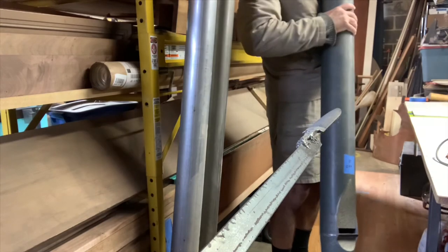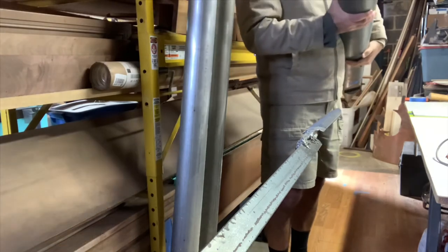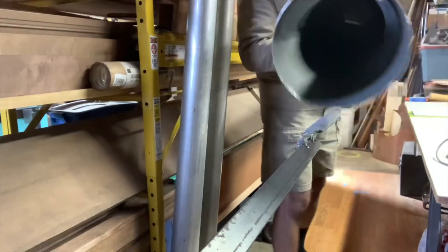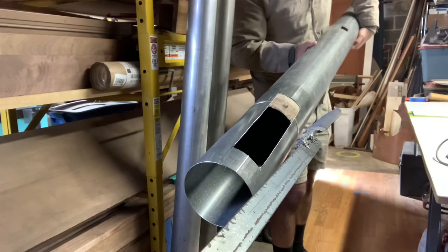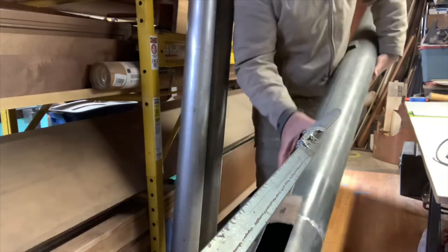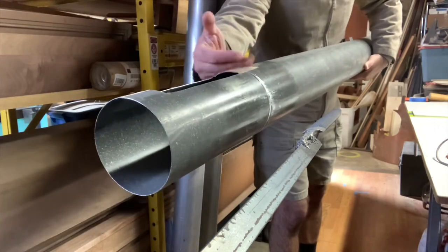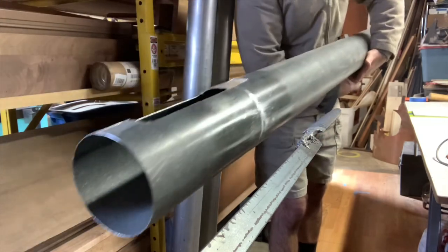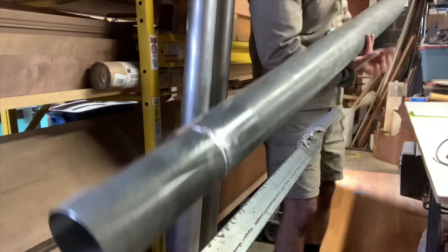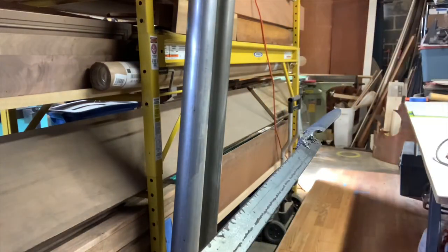This is a finished one, structurally that is. And guess what? I think we must have taken out the solder drops because, can you see? We've got the internal tuning slide already in place. The only thing we haven't done here is bend it over for a tuning tool to reach, because we need to pull it out for priming and lacquering later on. So this pipe is done.